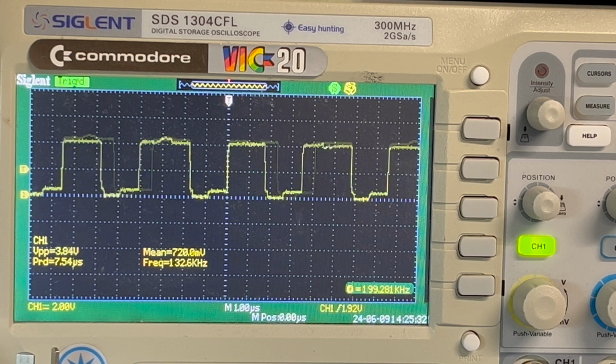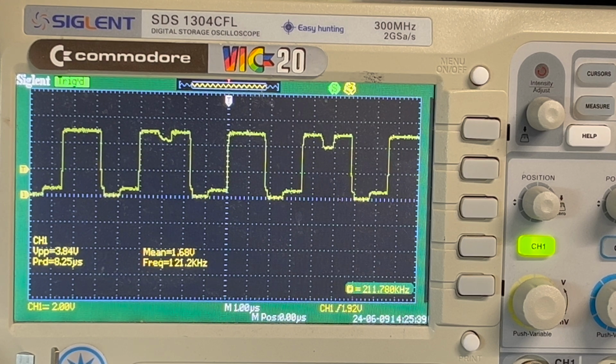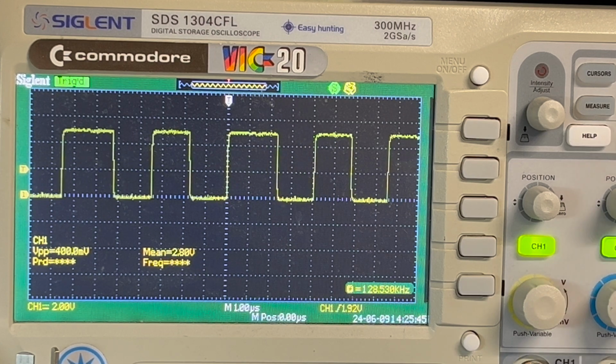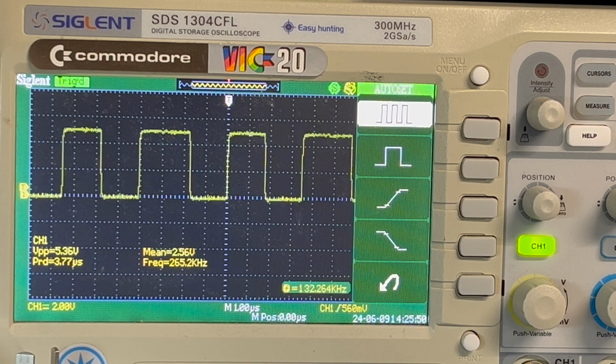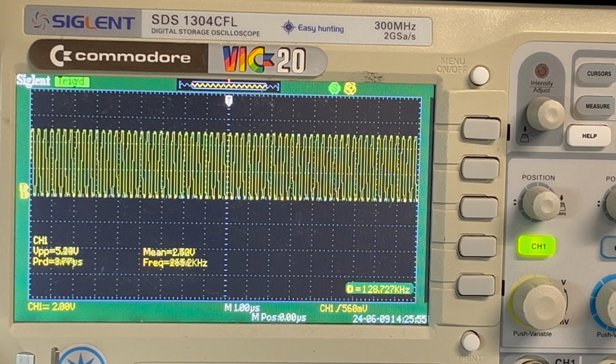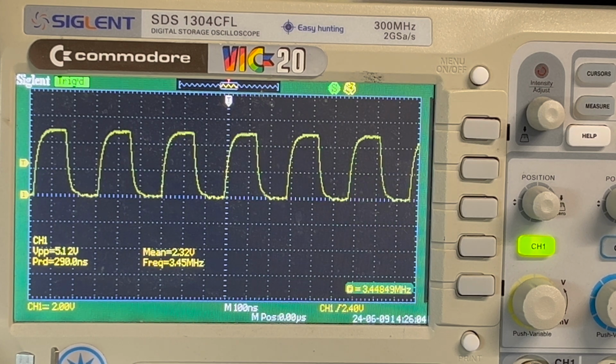That's pin 3? Pin 4. That's A14. Pin 5, which is A15. Obviously A15 won't be addressed so much. And then back to the clock on pin 6. Yeah, 5.2 volts. I think it's looking better.